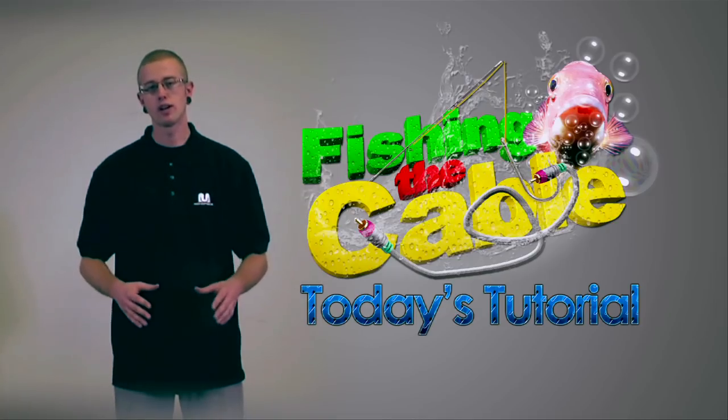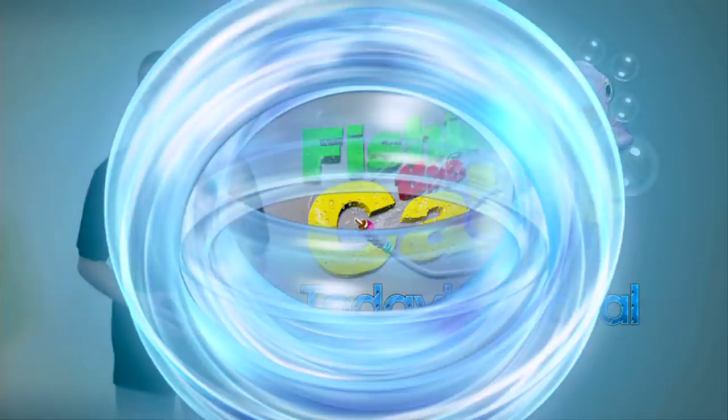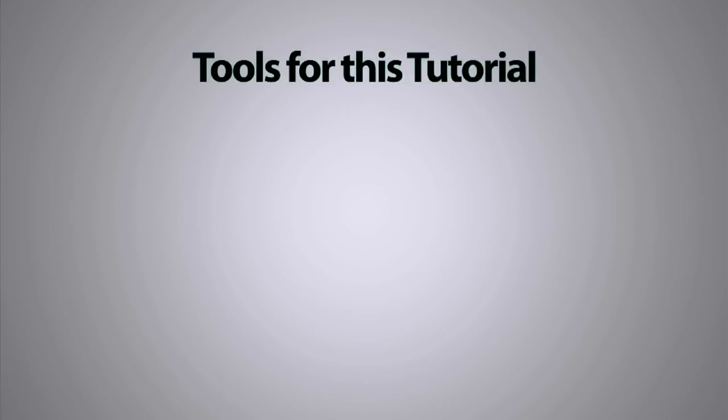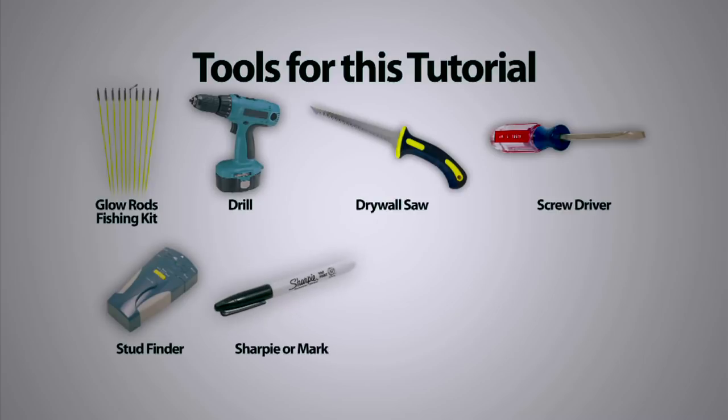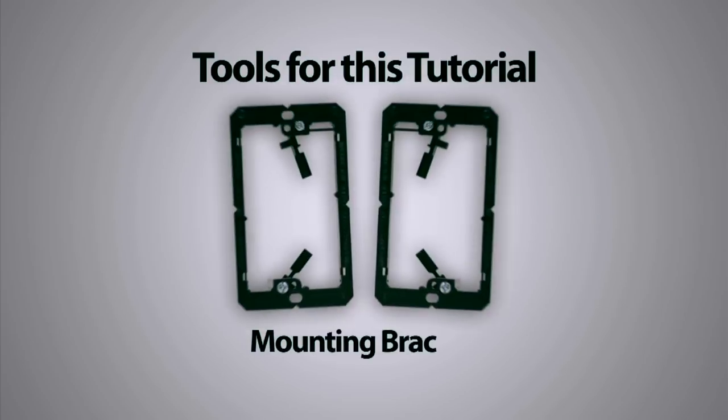According to the inner structure of your wall, installation may vary. For this tutorial, you'll need some tools: a wire cable fishing kit such as glow rods and fishing tape, a drill, drywall saw, a screwdriver, a stud finder, a pen or a Sharpie, a level, electric tape, and a mounting bracket.